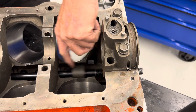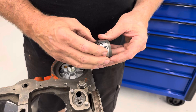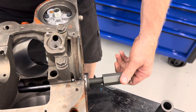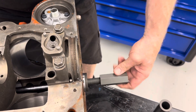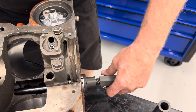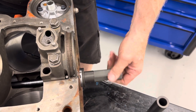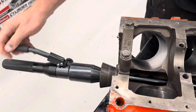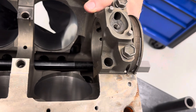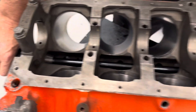Remove the spacer, slide the cone — or the mandrel — back out. Now go ahead with the number five bearing that we've already got marked. Put it in there, same nut. You can make this process a little bit faster by adding one of the one-inch spacers before you put the nut on. Pump it in — see how easy that is. And that number five is in.